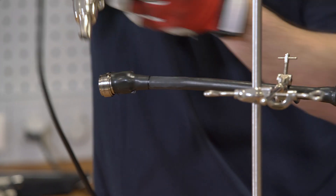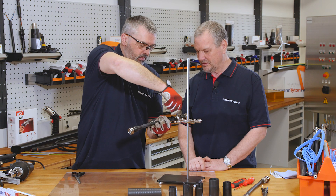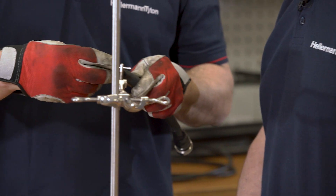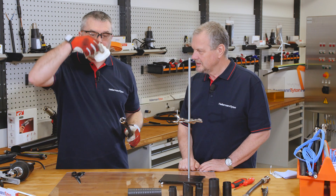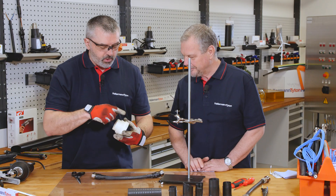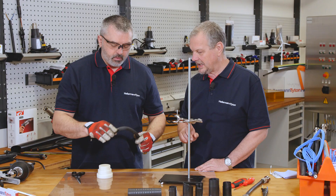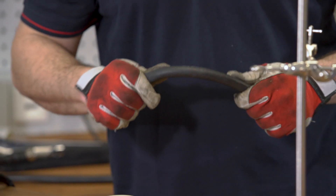While this one is setting, here's one prepared earlier. You can see we've got the bond and it's a perfect fit. Now that it's set, we can do our standard bend test around a standard former — the diameter is six times the cable diameter, so you pick the right size for your cable. The bend test ensures it doesn't crack at the joint. It's important to see that flow of adhesive around to confirm there are no cracks.